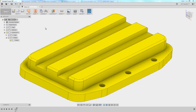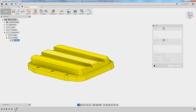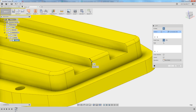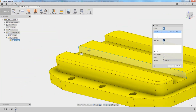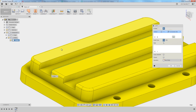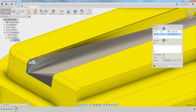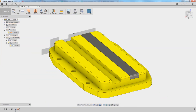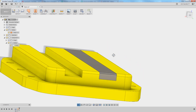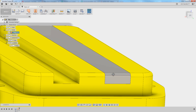Three different ways to do it — let's start with the best way. Create loft. Select one, two, three, four, five edges, and then select them in the same order, left to right on the other side: one, two, three, four, five. Click OK. So what is patch? Patch is this skin — it has zero thickness, but we're able to use it in CAM to do exactly the task at hand. I'll show that in a minute.